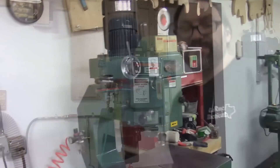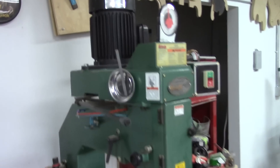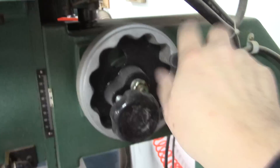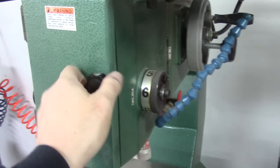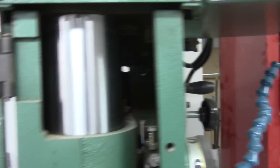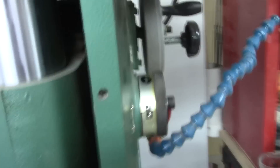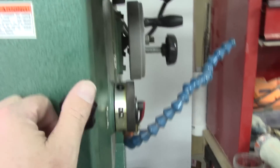You can pretty much see that the Grizzly is very, very similar to the Jet assembly. The motor is on top — again, a three horsepower single phase motor. It has the same kind of adjustment unit, only it's in millimeters here. Looking inside, it's got the same kind of thing going on as the Jet — the same wheel for setting the depth stop. They're really hard to get to on the Grizzly unit, so we've never actually adjusted those, but same kind of deal.